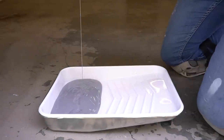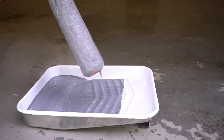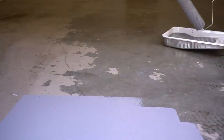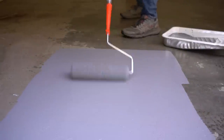The re-coat really does make life so much easier because it eliminates sanding, grinding, or even shot blasting. But I specifically didn't want to go down this route with this project because the existing paint was in such bad shape — I did not trust anything going on top of it. I wanted to completely remove that paint before doing anything with the epoxy.